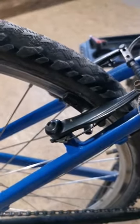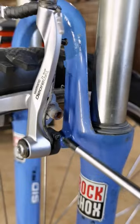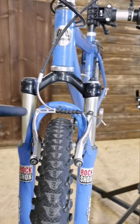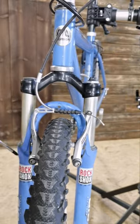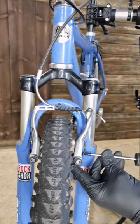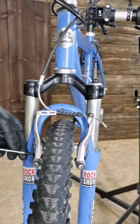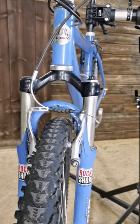The second reason can be these fine adjustment screws. If you want to mobilize this arm, undo this screw and tighten this one — so here counter-clockwise and here clockwise. That's it.